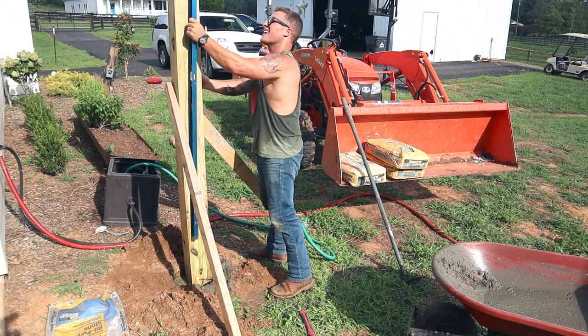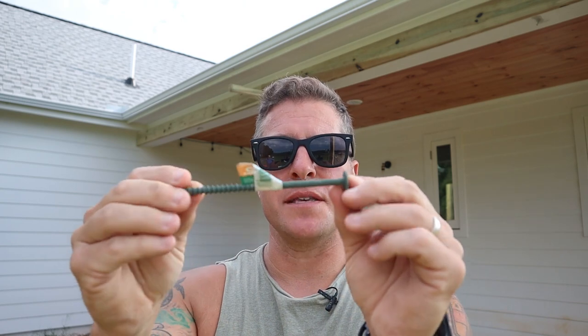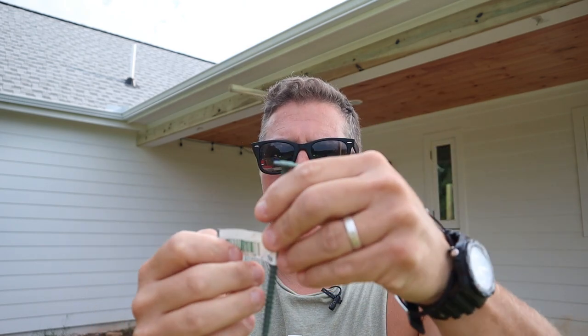Stage 1 of the pergola is complete. The ledger board is attached to the house. Once I get my rafters marked on 16, I will add these ledger attachments. These are just a power lag bolt, and they will go straight into the ledger on the house. Instead of having 4 corners, I'm just having the 2 corners on the outward side because the back of the pergola is attaching to the house. So it's kind of a hybrid situation.